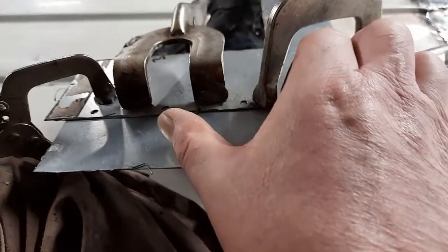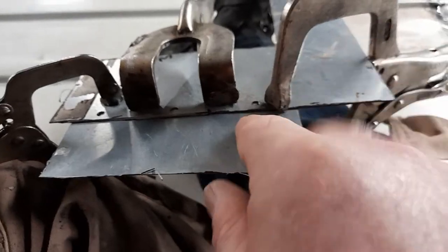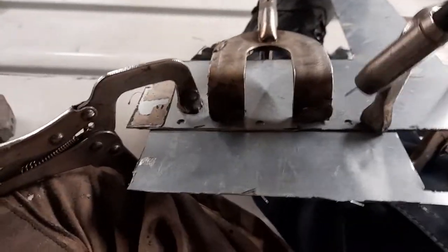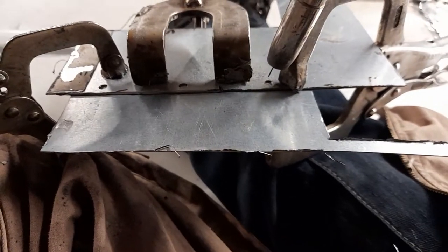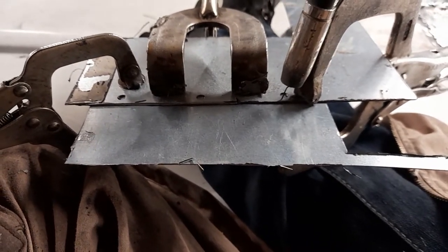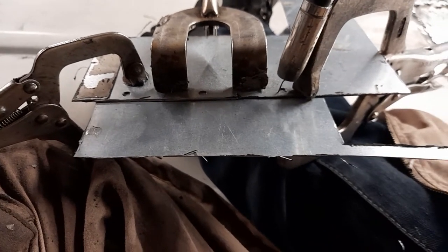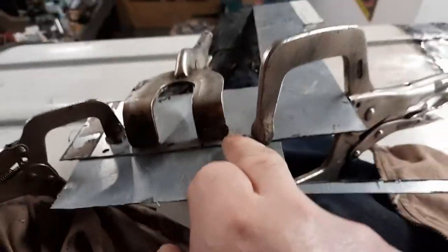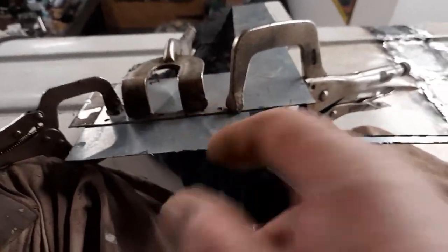You can generally see as the mask dims - the pool, because it's a liquid at that point, gets bigger around about where the weld is, and you can see if it's penetrated the second piece of metal. If it hasn't penetrated, I move my torch to the end of the pool and give it another burst for a couple of seconds. However, you could potentially blow through it.